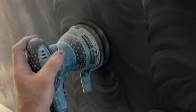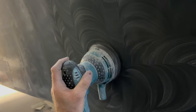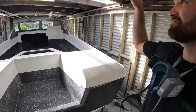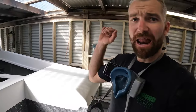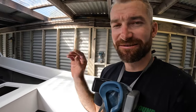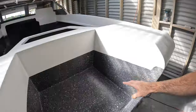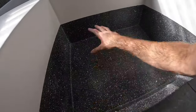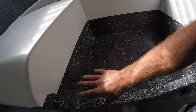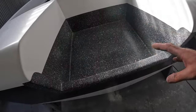What I want to do is finish that off once it's back out on the trailer. My main focus now is to get this flow coating done while it's still in the shed, then we've got to work out how we're going to squeeze this boat out because we don't have the height to come out. We're going to have to get the boat out first before we put it on the trailer. What I'm going to show you today is how I've been flow coating and how I've been doing this speckle, which looks really professional — I'm really happy with it.